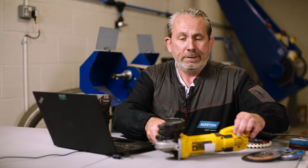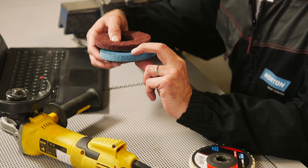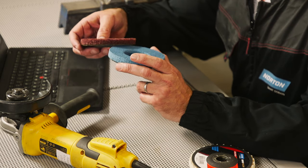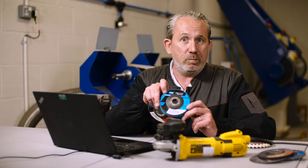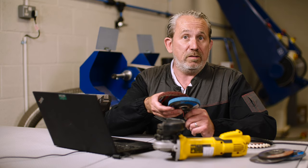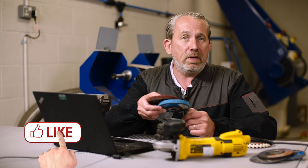What are these for? These are specifically useful when running products such as non-woven abrasives. These products are made out of nylon, which is very different to conventional grinding discs, and they are susceptible to heat — they can get hot and melt. Even though they are rated to run at 11,000 or 12,000 RPM, it is better practice to run these at a slower speed — around 6,000 or 7,000 RPM — to get the best result and reduce the possibility of smearing or melting onto your workpiece.